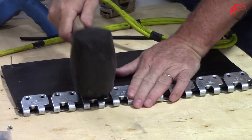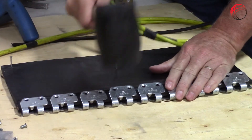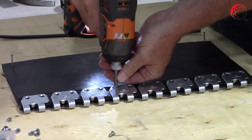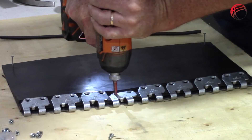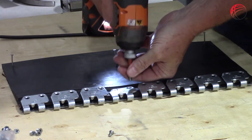Slide the MS fastener on the belt back to the belt stop and center on the belt. Using a hammer, you can close the fastener down onto the belt. You are now ready to install the fastener using an 18-volt power screwdriver with the PZ 2 drill bit, continuing to ensure the belt is tight against the belt stop on the fastener.